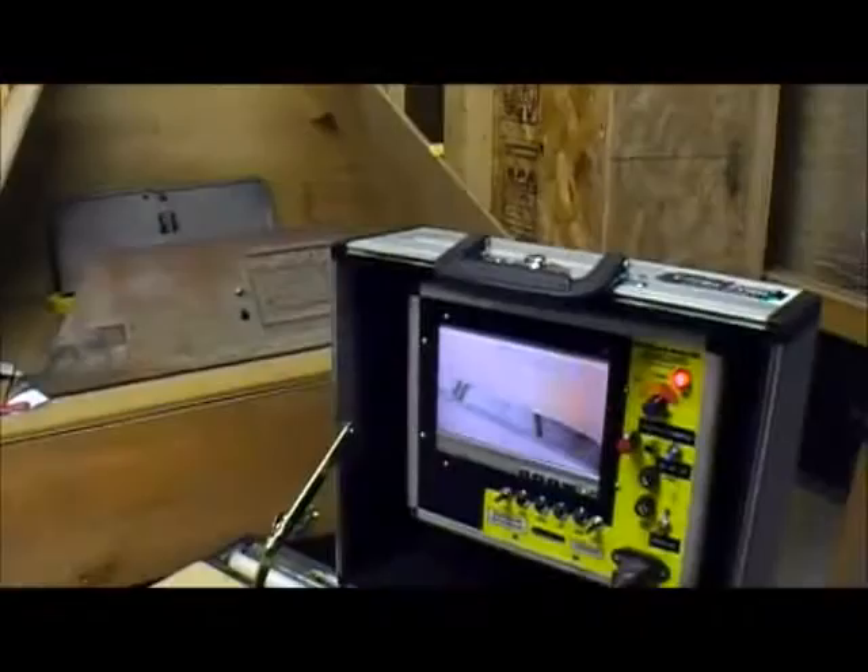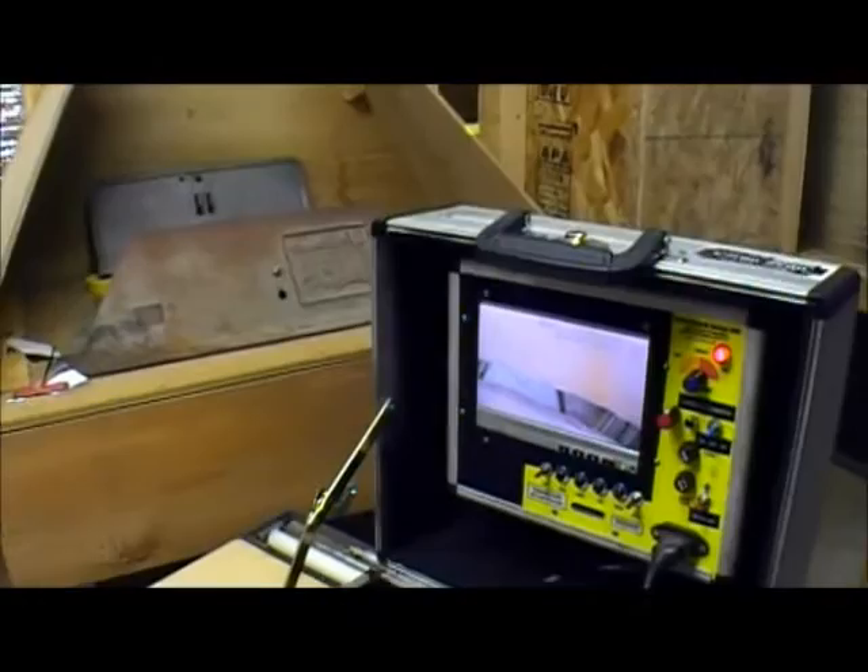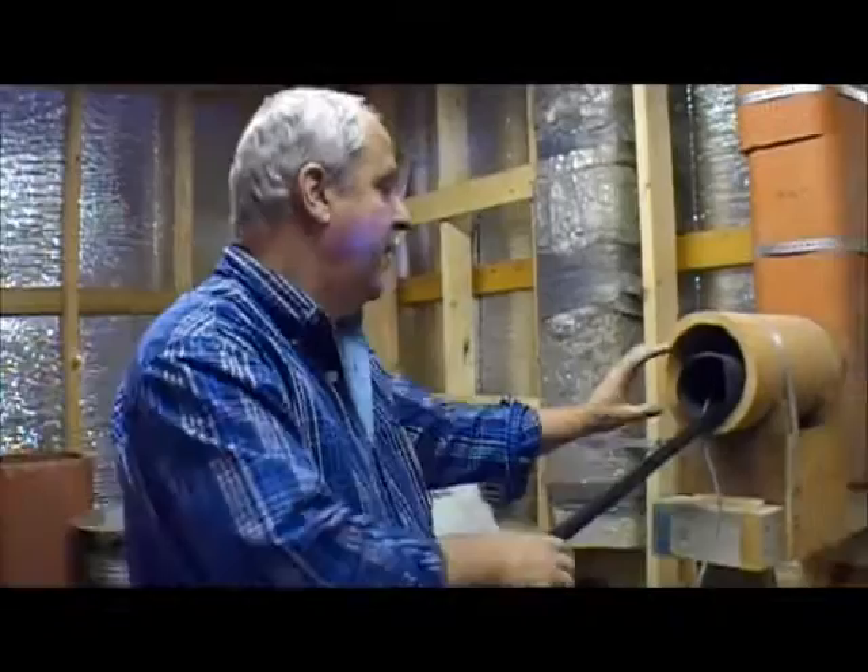If I add a second rod I'll push the camera up. It is stiff. I recommend that you have a half-inch white rod from the ROVAC folks because you need that actual stability and flexibility to get it through. With this right now it's a little tight, but I can make it. Here's my first joint — if you look up there you can see the camera sitting out there. It's a little tough to turn but I could turn if needed. It would be a whole lot better the further up I go — that's the reason why the half-inch rod is better.